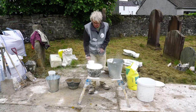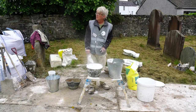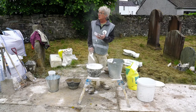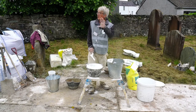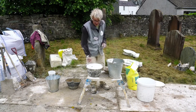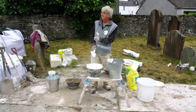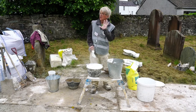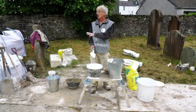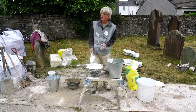To wet your wall in first? Sometimes, not always. I mean, you'll read contradictory things, and you'll probably know that Paris says you should apply lime wash to a dry surface in the Bible, the biblical text of the SPAB, Paris's book. I'm still evolving my thinking around that, but a little bit of water, and let it dry back, not glistening in the normal way. Yeah, some water doesn't hurt, and it depends on the time of year, it depends on lots of things, yeah? But I find lime wash attaches very well when you apply it to essentially a dry surface.